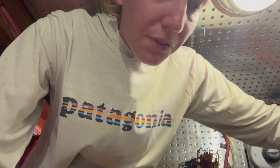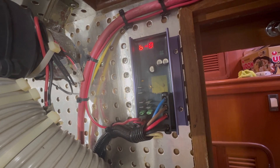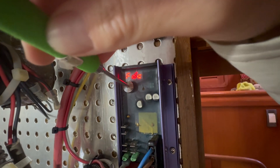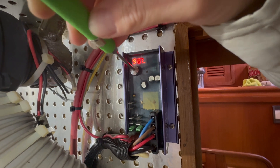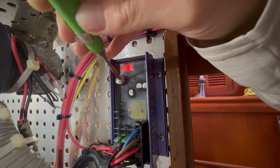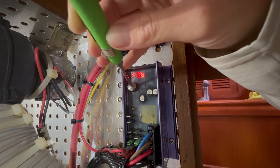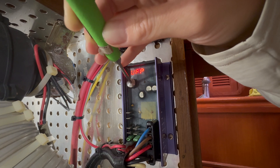Crawling around this room — we were just running the engine for a little bit because we did our oil change, replaced the fuel filter and the oil filter. So the engine was running pretty warm. Here's the Balmar multi-regulator, the Balmar 614. I think that means factory program. Now it's going to scroll through — FDC, float, deep cycle. Gel. Our voltage regulator did not have a LiFePO preset, so I went into the advanced programming and set a specific charge profile for our house bank, only to find out that our alternator wasn't putting out any charge.